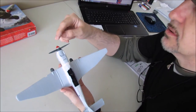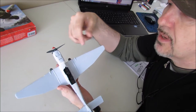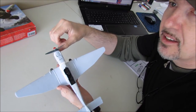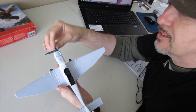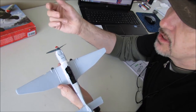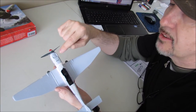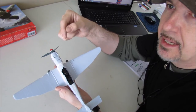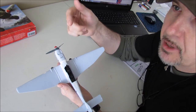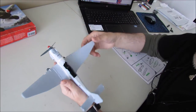Now let's talk about the issues. Thing one: I don't like having to assemble the propeller prior to painting the aircraft. You could put the spindle in place, glue it, and then assemble the propeller onto the spindle — but it wouldn't rotate. Or you could do something clever: put a cup-shaped bushing on the back that presses onto the back of the spindle to stop it falling out, and glue the bushing in to trap it. But I didn't have anything to manufacture that, so I don't like that.